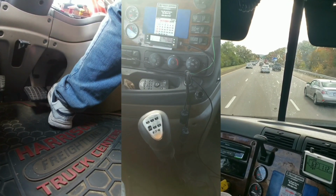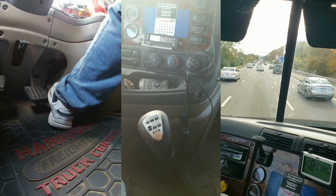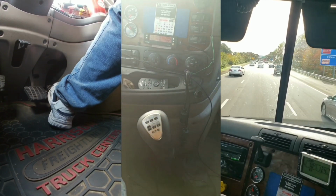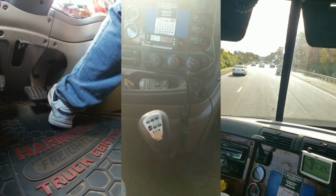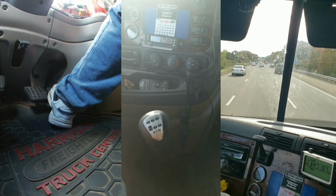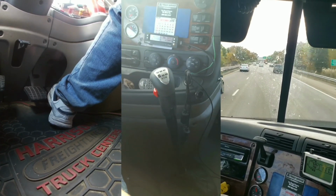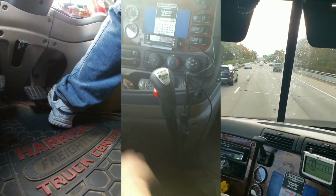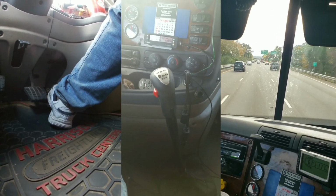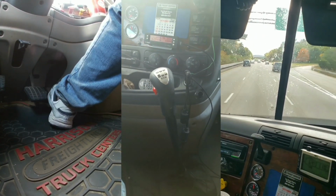Operating range is basically from 1200 RPM to 1600 RPM. That's where it makes the most amount of power. But with that said, you want to be absolutely brutal on the power, around about 1400 is where it starts really coming in hot and strong. So, keep it around about 1400. If you're trying to climb something and you want all that air to go in and not absolutely melt down the pistons, keep your RPM high so you can feed as much air into that system as possible. Make a lot of power. Absolutely.